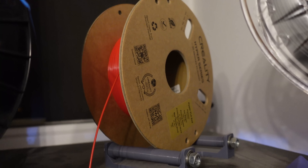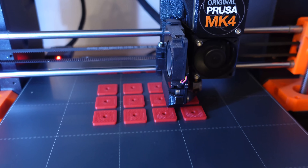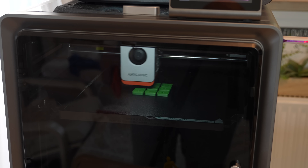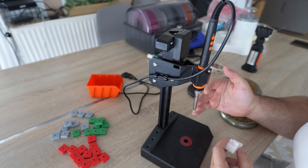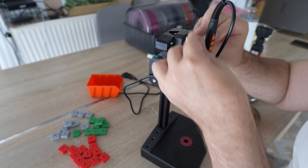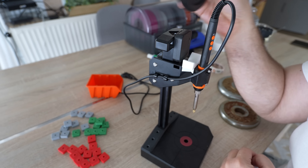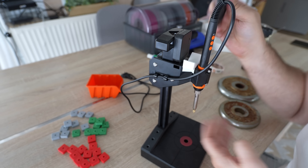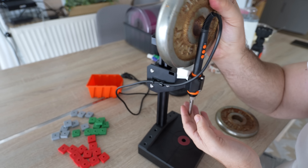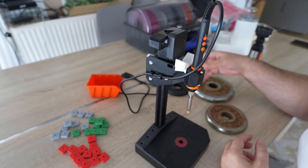Let's look at the materials I will use: Creality Hyper PLA, PETG printed on an Anycubic Kobra S1, and Polymaker Polylight ABS also printed on an Anycubic printer. All objects are printed with 5 walls and 50% infill. In the first part of the experiment I'm testing different speeds, with temperature set to 240 degrees Celsius for all 3 materials. I cannot really manipulate the speed directly, but rather the force I use for pressing in. First I'll try with a 0.5 kg weight for very slow inserting, then approximately 2.5 kg for extremely fast inserting. In practice I normally use about 1.25 kg of force. I'm using this big difference in load to create a noticeable difference in effect.